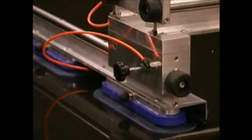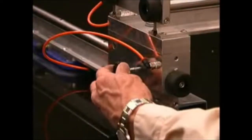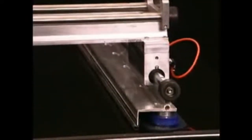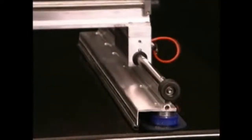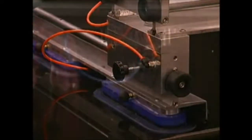Lateral movement of the head. On each side of the machine, in the linear rail truck assembly, you will also find rail locks. Release these in the same way as on the machine head, turning those counterclockwise. Then bring the machine to the front of the stone. Do not pull it beyond the edge of the stone if you are on a narrow top.